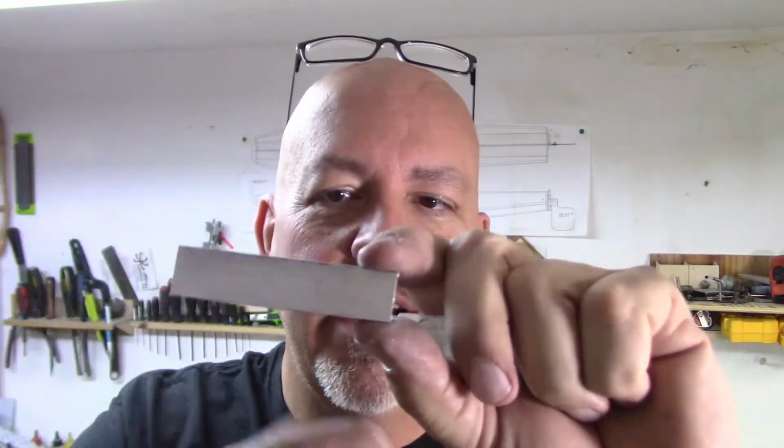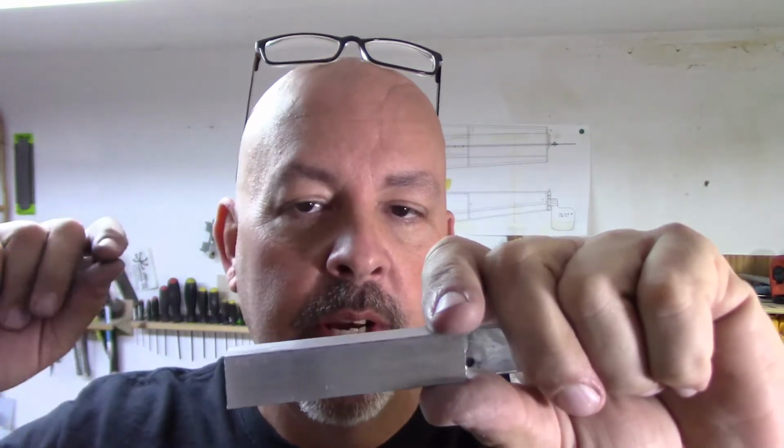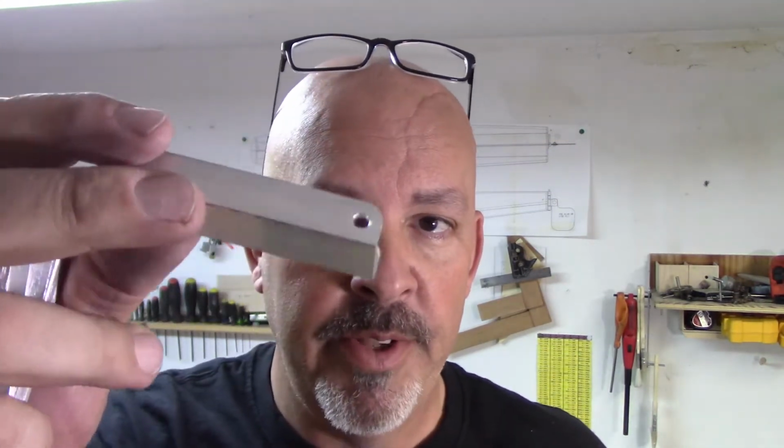All right, I'm back. I got the hinges made. The hinge points. Let's go ahead and show you real quick. The one for the trailing edge is real easy. I haven't cut these to final length. I want to get everything lined up properly on the fuse, and where the bolts are going to go through to attach to the fuselage, before I go ahead and cut them to final length. Here's the one for the rear mount on the fuse. It's easy. It's just some U-channel with a hole drilled through it and angled.